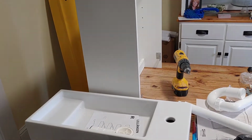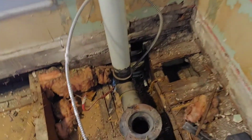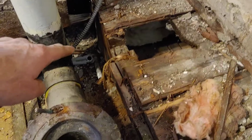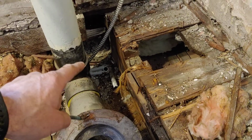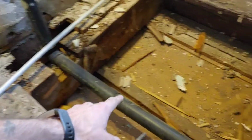All right. Okay, so I just cut out all the old plumbing. That's where the leak was on the supply side in the old copper. So there's my cold and hot. It's going to be tough to get the crimping tool in there to put a union on there, but if I can, I'll just simply loop this around and make this come out to here somewhere.